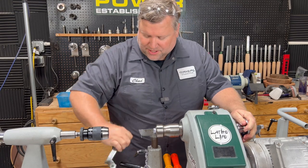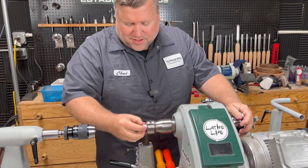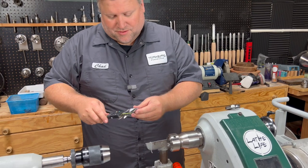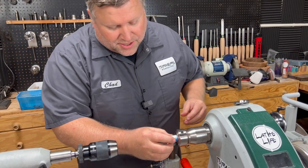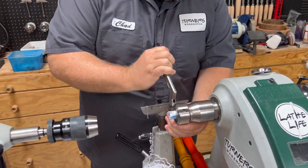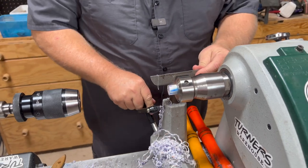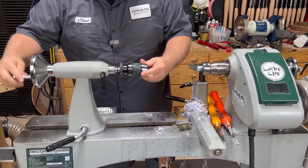I'm going to expose a little more material — I don't need a lot, but I need enough to cut those eight millimeters of thread. Let me test measure, make sure I didn't overdo it. It's still 30 millimeters, but it's pretty short, so I'm going to leave out just about half. I've already set up my tenon cutter, so I'm ready to cut my threads.